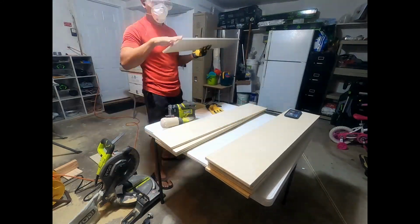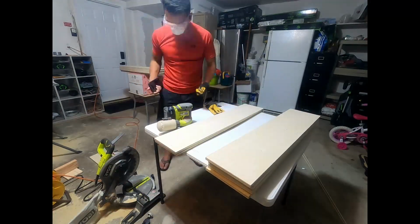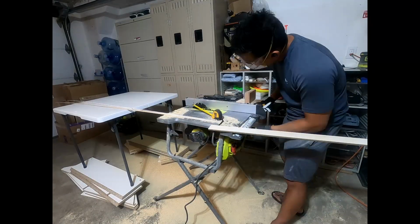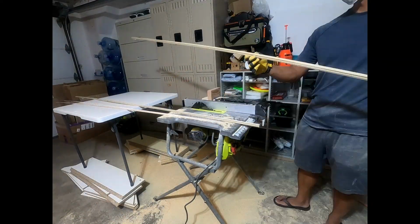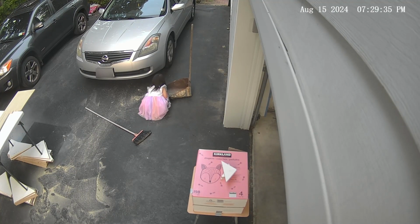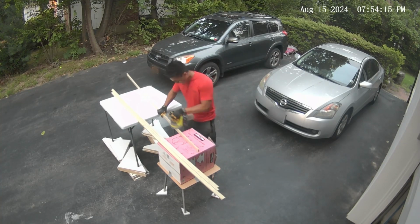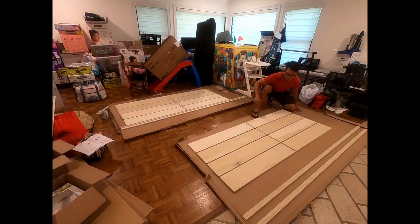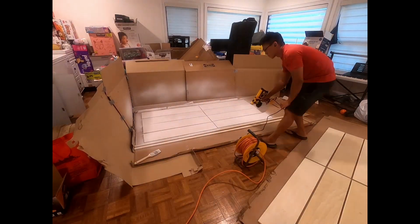That really didn't work out to make all the drawer faces exactly the same space because some had 3 drawers, some had 2, and the space between each one wasn't the same. When you look at it, you'll see the difference. Just the heights were off. So we ended up just making the bottom drawer of all of the units the same size, and it would be bigger than all the other drawers. And then when you do the equation for that, everything ends up working out,